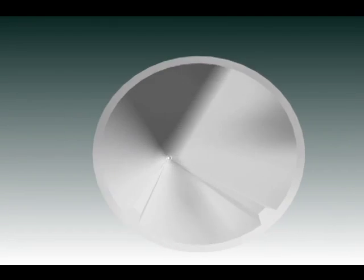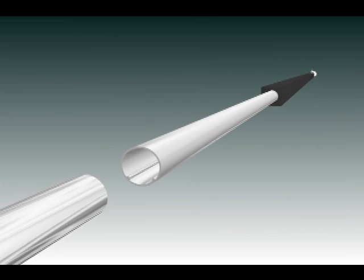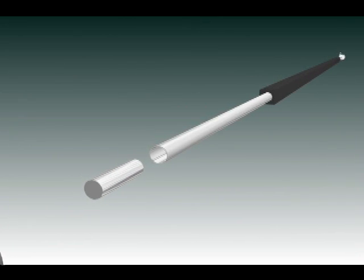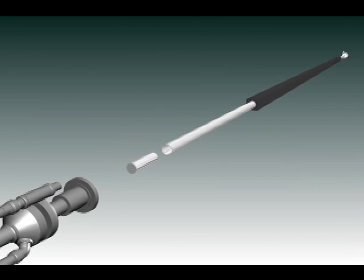So we need to be able to charge this. Inside the process tube you'll find fuel elements. Those fuel elements are natural uranium or slightly enriched. They're each one and a half inches in diameter by 8.7 inches long. That's a standard fuel element.